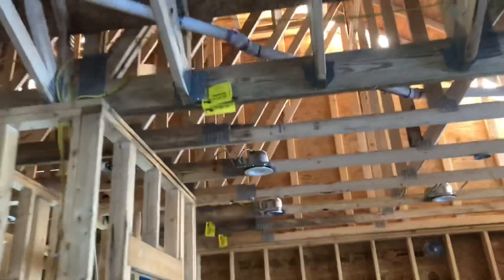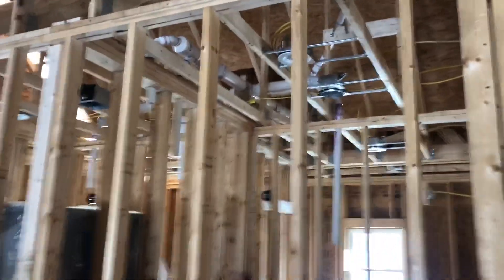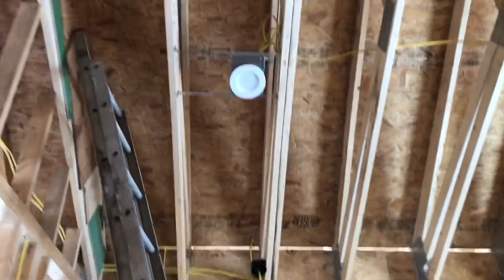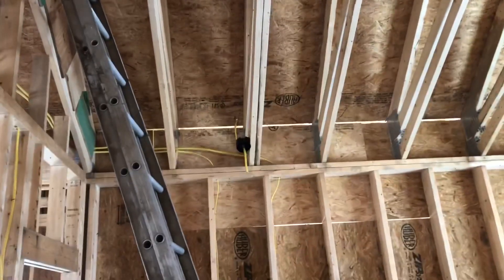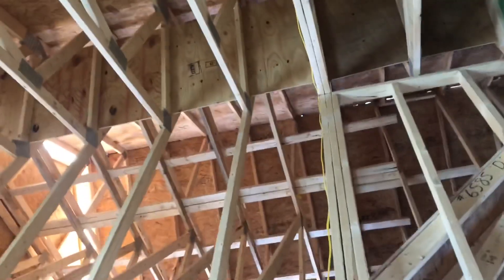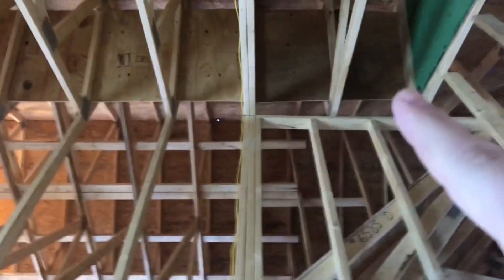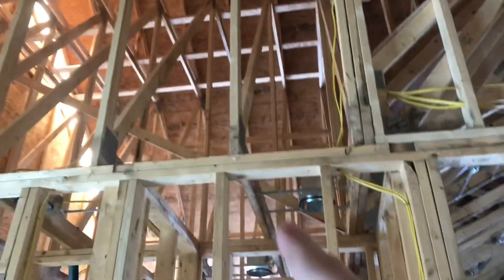Phase 2 of the project — they're going to come through and put sheetrock up on this ceiling here. Flat ceilings back here. We're coming to spray down on these little ceilings. This one's a little tricky, testing our thermal envelope knowledge when we're bidding the job. Right here is a scissor truss system. We're spraying the roof slopes all the way up there from the eave up to this little blocker material that they made for us, right there, all the way across. The reason they had to block that off is because we're spraying this flat ceiling back this way.